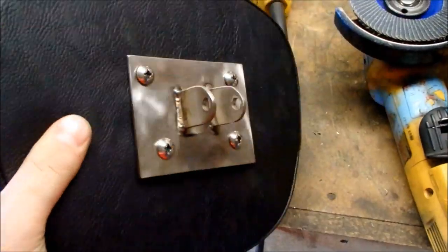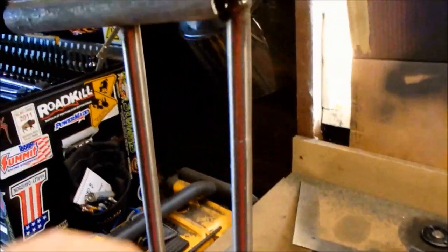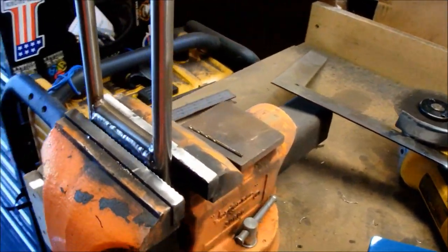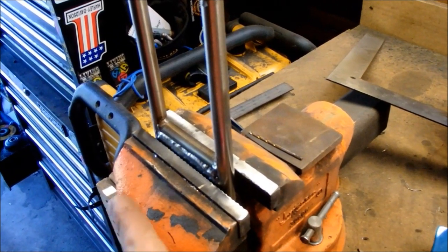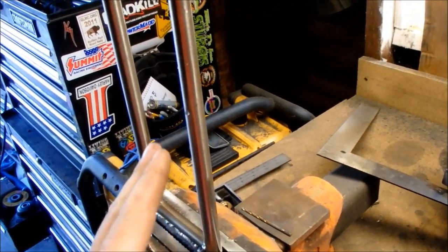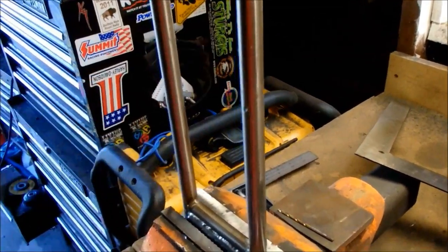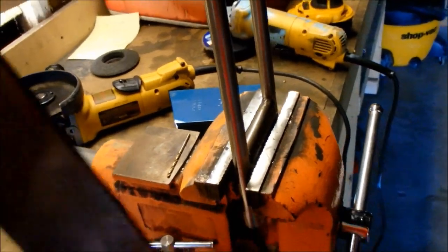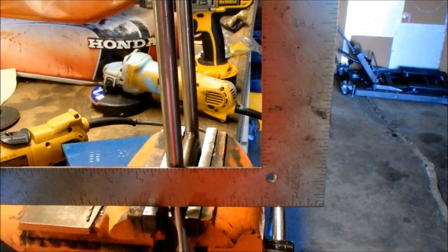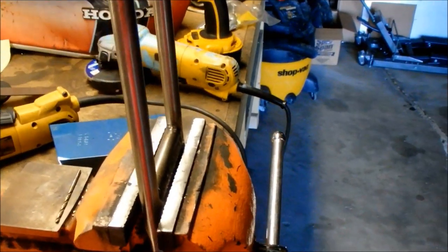There's the backing plate attached to the pad. I'm going to assemble that and figure out what height I need. Next I'm going to heat right here and use this piece of pipe just to keep these two from twisting, but also so I can grab it and pull it back. I need a 3-inch offset from the rack up to the passenger. So I'm going to make this come back 3 inches, then I need a 4-inch rise. The angle is going to be 5, so I'll cut these off 5 inches long once I bend them back. I'm no math magician, but I put it on 3 and keep this level with the bench — it should be about where I need to end up, so a lot of this is by guessing by golly.